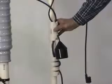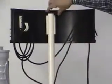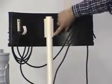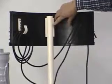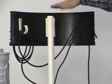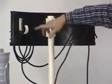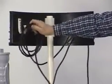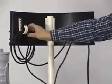This is our hardwire float holder, and at the top of our pipe here, our float tree, is our float tree bracket. This bracket gets fastened anywhere from an inch and a half to 4 or 5 inches down from the top of your riser. This here would be the ground surface right here. We also have J-hooks to organize our wires. Sometimes there'll be 2 or 3 of these J-hooks in the system to accommodate all the wires and pull ropes.